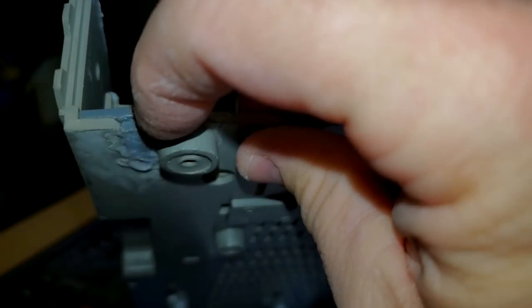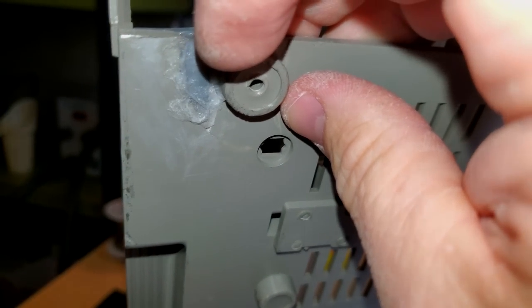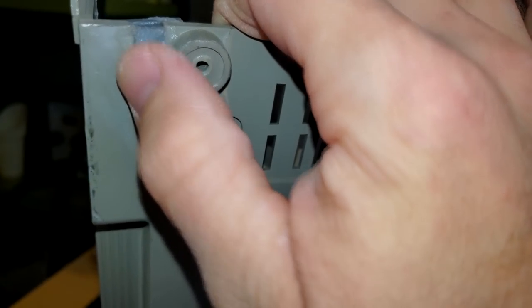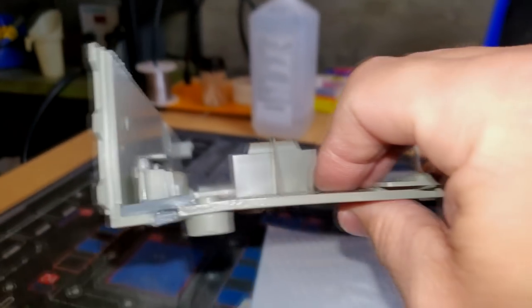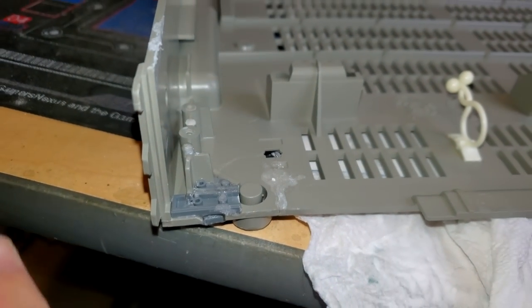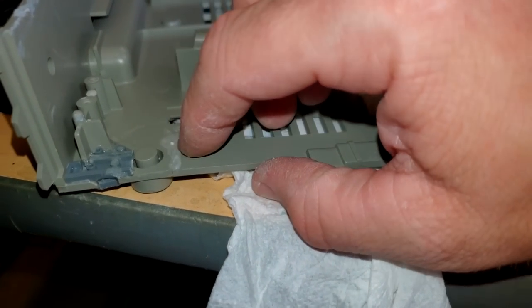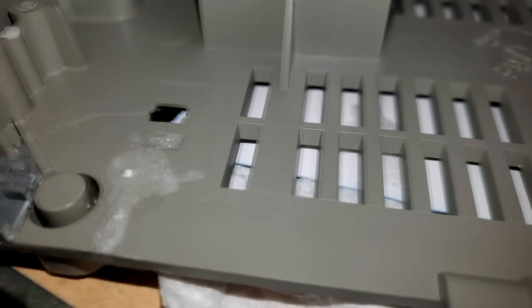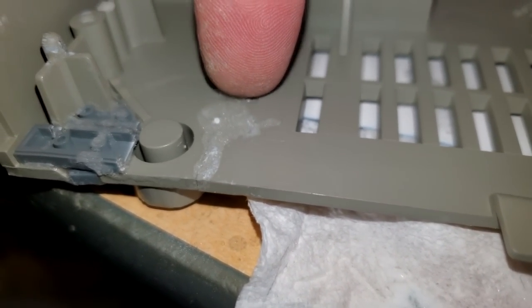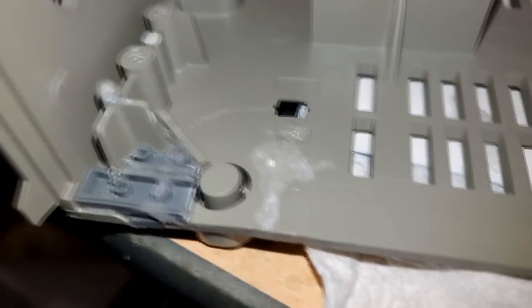We've got that one Lego that's been kind of cut up and now installed in here, and it's literally nothing more than super glue and the baking soda, and I sanded it down a little bit. So it's not like the prettiest repair, but this is the bottom of the monitor anyway. But it is extremely hard, and there were some other cracks, and I put some super glue down in those cracks and also added the baking soda right in there. And then obviously this is really well bonded right in there.